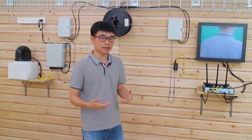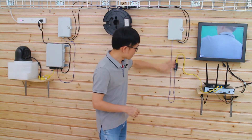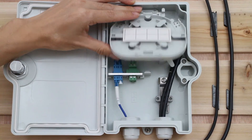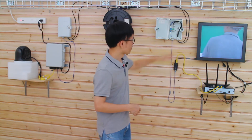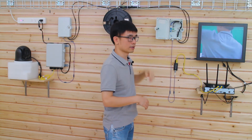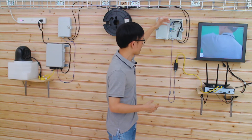The SFP transceiver — this small one — determines what kind of fiber optic cable you can use: single mode or multi mode, and what kind of connector you can use. From the media converter, we run a patch cord to link to this box — it's simply a box to manage your fiber optic cable. From this box, we run the long-run fiber optic cable to the main gate — about 1,200 feet. We are using pre-made fiber optic cable, so the customer doesn't need to fusion-splice the connector; it's made in the factory and you just plug and play.